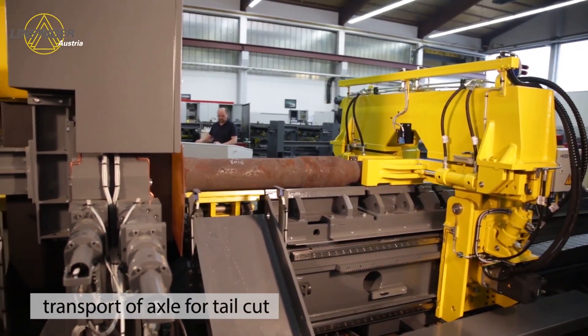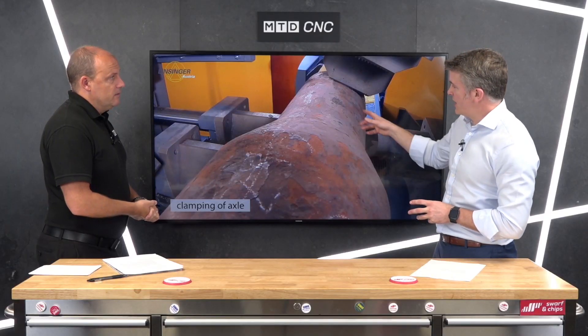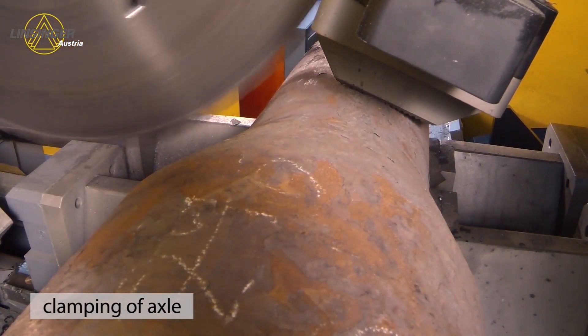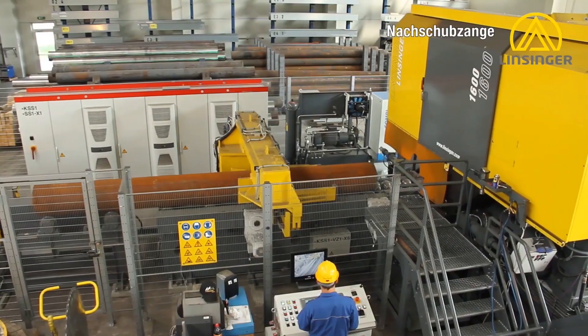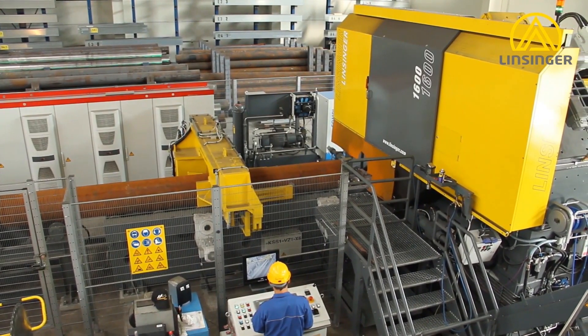As you can see, if you've got a forged part or similar, it's difficult to grab hold of an uneven surface. So what we've actually got is three-point clamping — two at the bottom, one on the slant bed, one at the front.